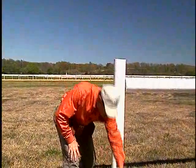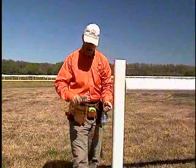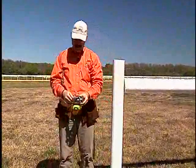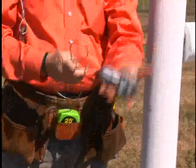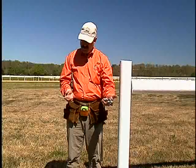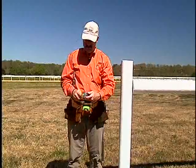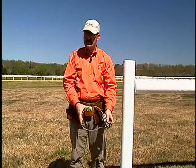Now what we're going to do, we're going to show terminations. We're going to show a termination for an electrified strand. We have our fencer's lasso already incorporated. The insulator is already within the inline strainer itself, set up to go around the post itself. We'll accept up to an eight inch diameter post.